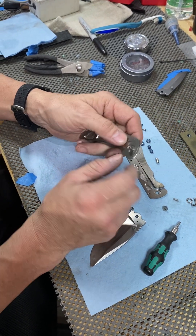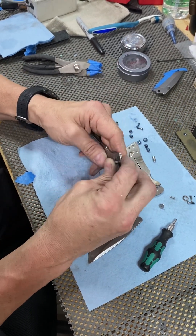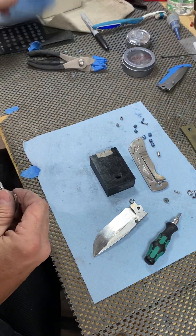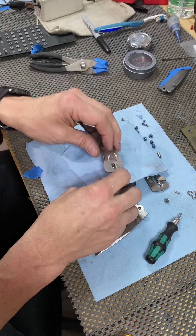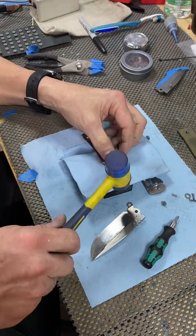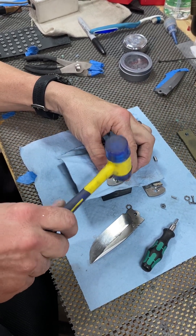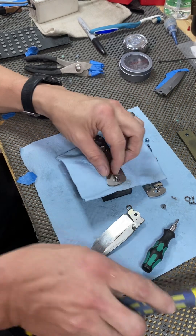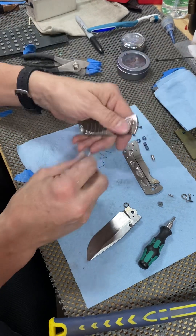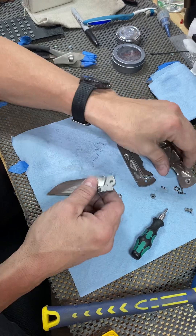Some of you may have a knife where we used to press-fit the pivots in a little tighter than we do now. Most of the ones now you can just push out with your thumb and pop it out. If you have any trouble, find a little block or something with a hole in it. Carefully put something down so you don't mess it up, use a rubber hammer or put a piece of wood over it with a regular hammer, and give it a couple of light taps till it gets started, then push it on out. That's for some of the older ones that still have a tighter press fit on the pivot.